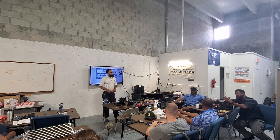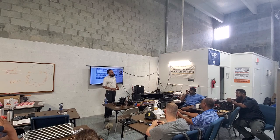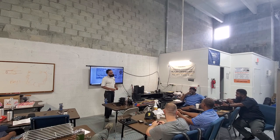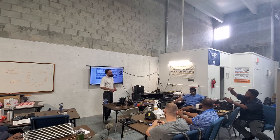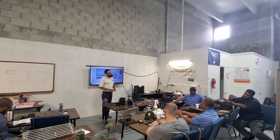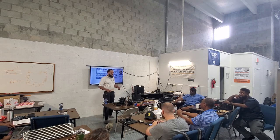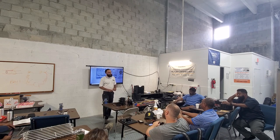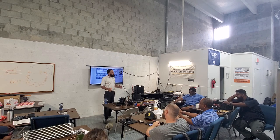Basically, he was saying the micron gauge will tell you for real if you have a leak. But he was also saying that when you have your regular gauges and then you have it in the vacuum, you can get 10, you can get 20, maybe 25, but 30 is kind of... You'll get it down there, bro. Very close to that.